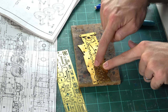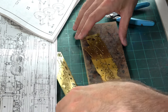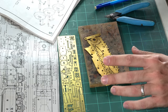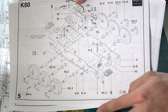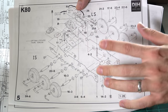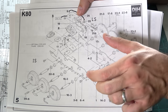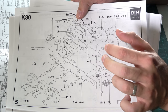We need to remove the main bits from the frame fret. We've also got these spacers — there are various ones we're going to be using for this chassis. The instructions look quite complicated but if you go through it logically and mark off the bits you don't need, it's not too bad. I've got rid of the bits for making an EM or P4 gauge chassis, which is slightly wider than what we're doing — we're working double O.